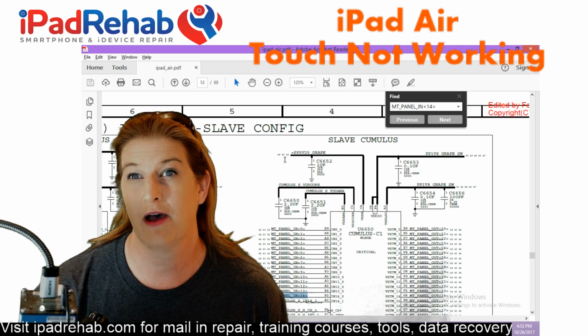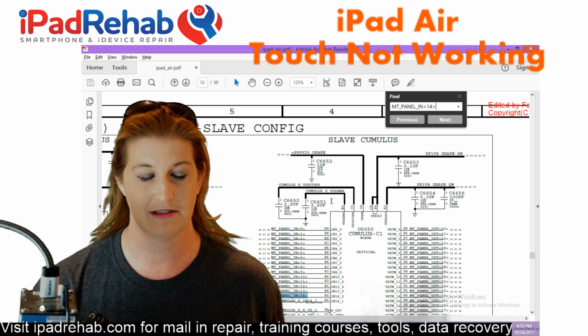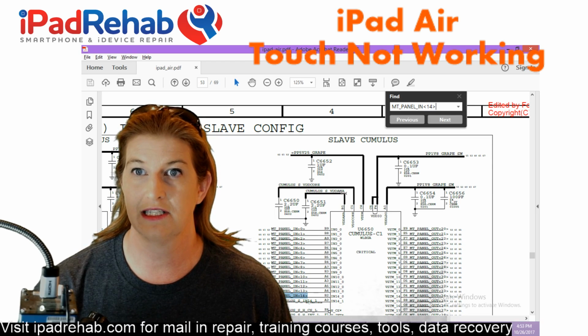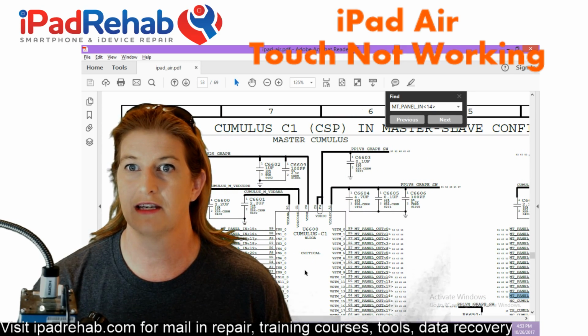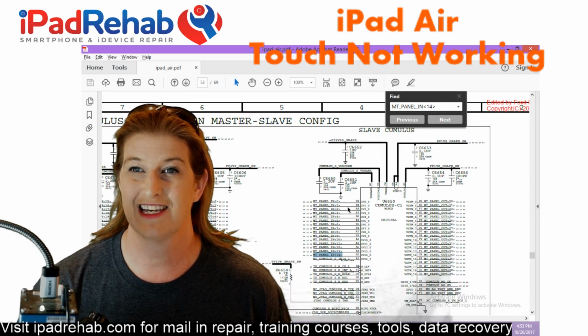Looks like this chip gets power from some line called PP5V25 grape. And then it has this weird line. It's the same thing that goes on with a cumulus when I've looked at it in iPhone 6. So SVDD core and SVDD analog, I guess. And then over here, we've got this PP1V8 grape SW coming in here twice. Let's see if that's the same or different over here. It's exactly the same. So both of these touch ICs seem to be powered by the same power rails.